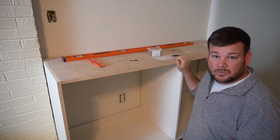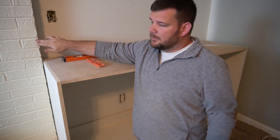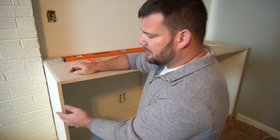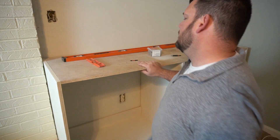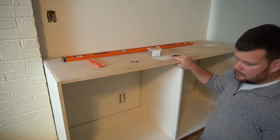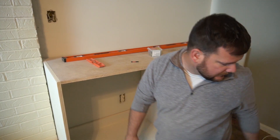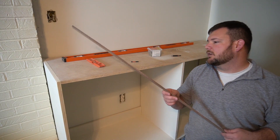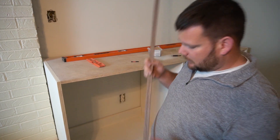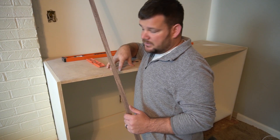Your house walls are probably not perfectly straight, perfectly level, or perfectly perpendicular. That's the problem I have — this fireplace and wall do not create a 90-degree angle like this built-in does. The floor and the wall also don't create a 90-degree angle, so I have a little bit of play in there. What I'm going to do is set them to level using some walnut cutoffs from the countertops as shims — shimming the underside and a gap in the back before I screw them to the wall, so the whole thing sits level.